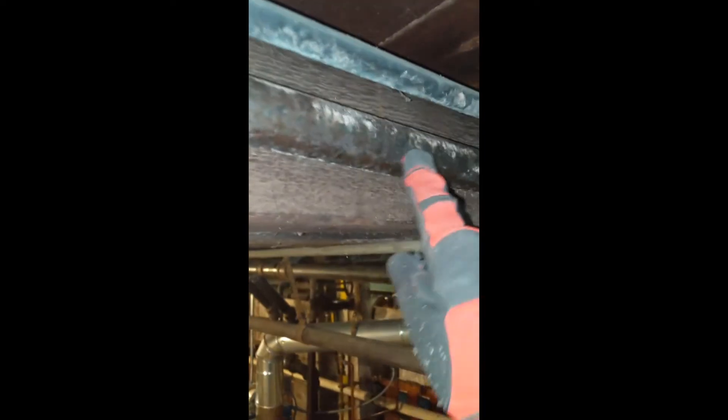I checked all the water pipes in the basement to make sure that they're angled correctly and sloped down towards the boiler, which they should be. If you look at your pipes, like this one, it's coming down at the bottom of the floor joists right here, and it's starting up here at the top of the floor joists. You want to make sure your water pipes coming from the radiator are angled in the basement so that the water can flow back into the boiler.